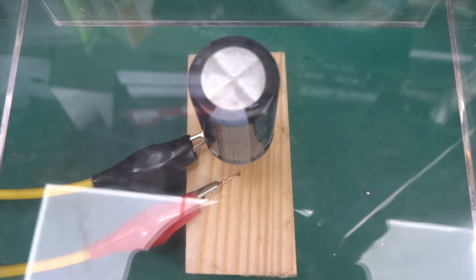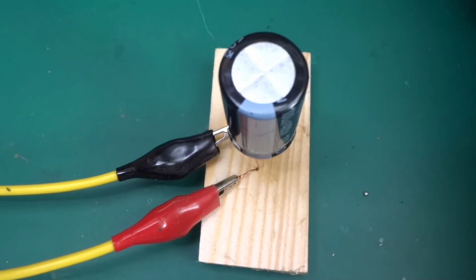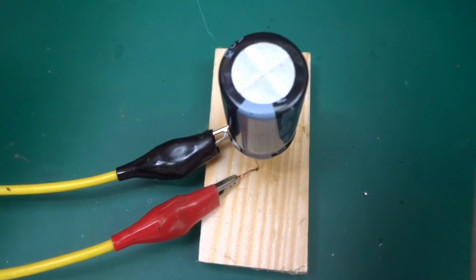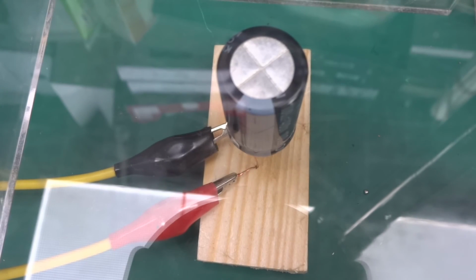Okay, I think this is not gonna go very well, so let's switch this off. And what I'm going to do is engage dual power supply, and I just need to bridge positive and negative of the 2 channels, so I'll get up to 60 volts. Output on, so that's 40 volts, 44 actually. So let me up the other side. We've got 31 and 16, drawing 100 milliamps.